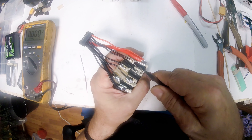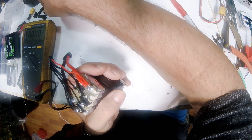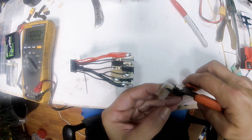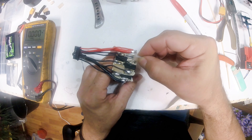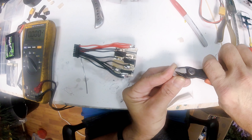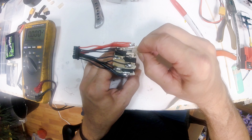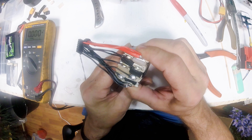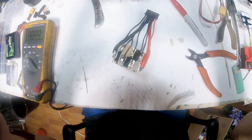I'm going to remove this rubber piece and put a silicone one in there — a longer, taller one. That one's too long, so I'll cut it down. Even when you cut off pieces like this, save them — you will need them eventually. That goes right in there and you squish it down. Now there's no possible way, no matter how hard I squish it, that those two tabs are going to touch. That battery is completely done now, so let's check it with the battery charger and make sure — we'll check the resistance and all.